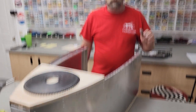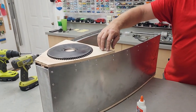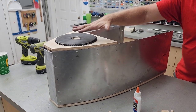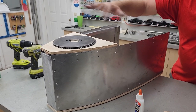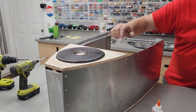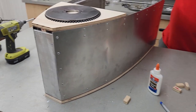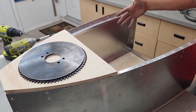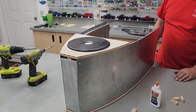Let's get a look at the tail section. Here's where Dennis and Stephen have been working on the tail. We're making a plywood buck — basically the foam will be glued to this and then we'll work it into the shape we want. This is being glued right now. You can see the wood here for the fiberglass — everything is going to be fit to this so we have a nice beautiful Grand Prix style tail for the Samson.